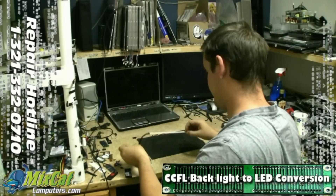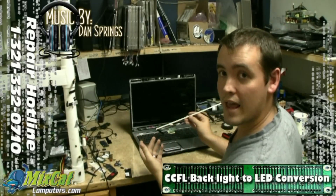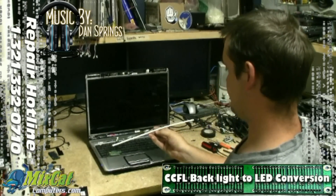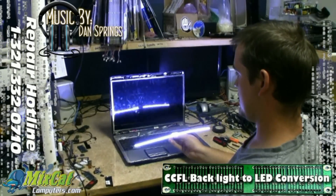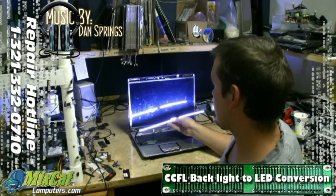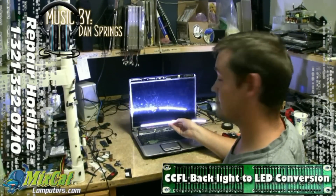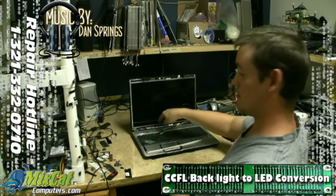We're going to go ahead and show you that now. What I'm going to do is kick this on so you guys can actually see what happens. I've disconnected my laptop's inverter, I've plugged in the LED backlight controller. I'm going to go ahead and fire that up. As you can see, pretty bright. I've got my computer turning on — obviously very bright. It doesn't run hot, I'm holding it right here in my hand. Windows started up. So now we're going to go ahead and install this in the screen — we'll show you all that in just a second.